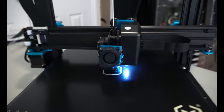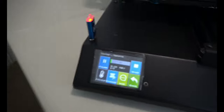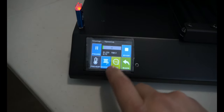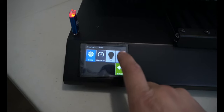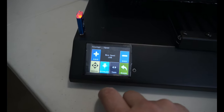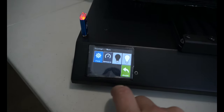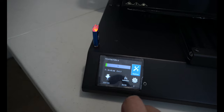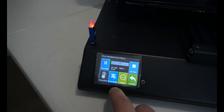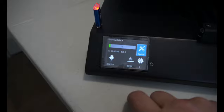It said it's a cube and it's already looking cube-shaped. The extruder is so big it's hard to get my finger in — it's sticking pretty good. Now let's see what options we have for on-the-fly adjustments. Fan, light — you can turn the light on and off. Speed, extrude, move speed. The one thing it doesn't have, unless I'm just missing it, is any type of baby Z-step option, so I can't actively lift and lower the nozzle while it's printing. That's fine though — as long as your bed's leveled properly, this will never be a problem. We're printing away.